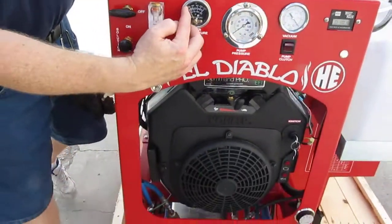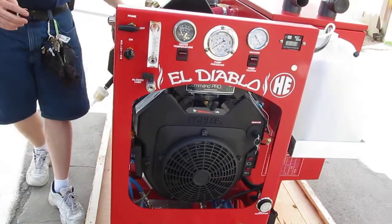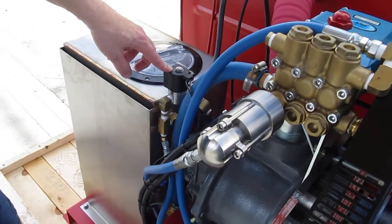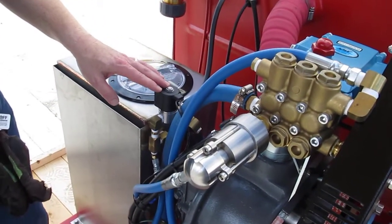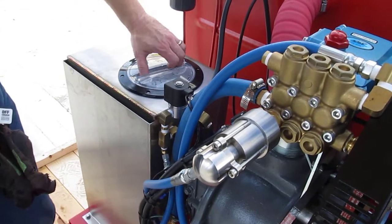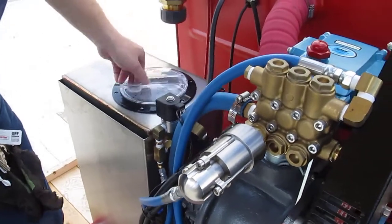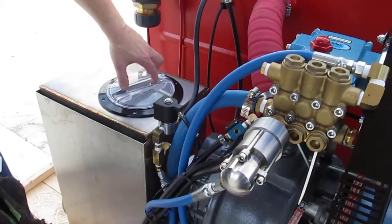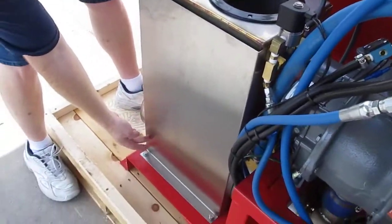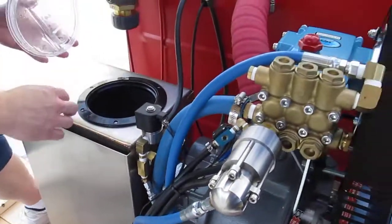When the two needles touch, it's going to actuate this solenoid. This solenoid back here, when the water is getting too hot — when it gets hotter than 235 degrees — it's going to open up and suck water out of the bottom of the mix box. There's a hose going all the way from this entry point down to the bottom, and it's going to suck the water off into the waste tank when it gets hotter than that.